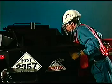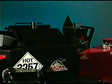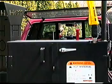If too many blocks were to jam the agitator, reverse the agitator valve at the manifold to clear the jam, or simply turn off the agitator drive valve and give the tank a few minutes to melt the blocks down.